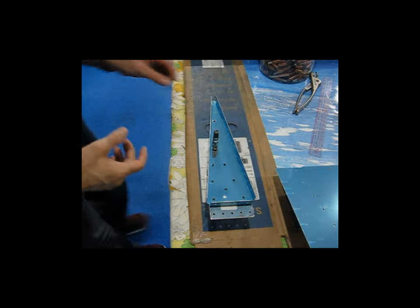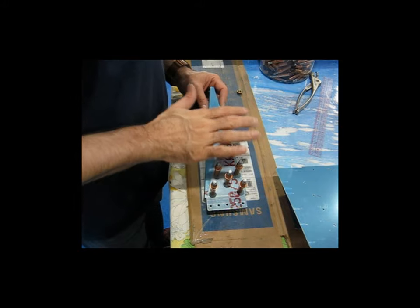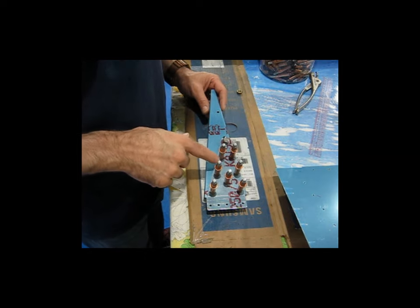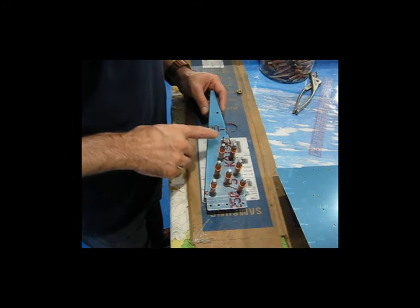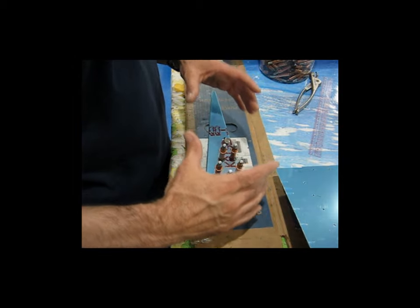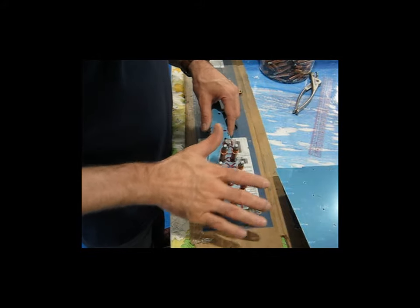Back at the bench, I have the assembly put back together. And again, like I've said many times, I like to cleco as much as I can. Whenever I have parts that have been match drilled and there's times when you have to disassemble and reassemble multiple times, whenever I do the reassembly, I use as many clecos as I can just to be sure that everything is as exact as it can be to the way that it was before it was disassembled. So I've got all my clecos in,